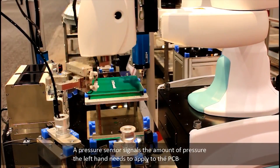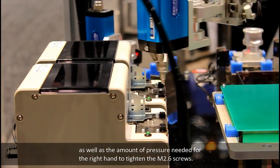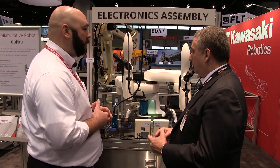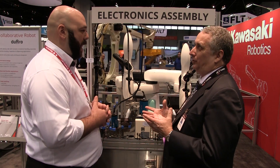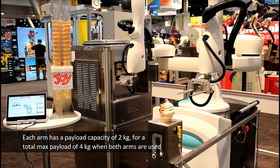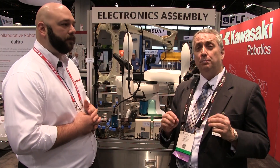Built into the sensor here, we have three key-on sensors that show us the torque, all communicating directly to the robot. Once the torque is achieved, we release the vacuum, stop spinning the gun, and pull away. As for accuracy and repeatability — with four-kilogram payload for both arms working together, or two kilograms individually per arm, we can achieve 50 microns of repeatability. That's high repeatability and efficient production for delicate assembly processes from Kawasaki Robotics.